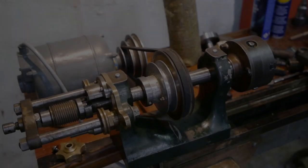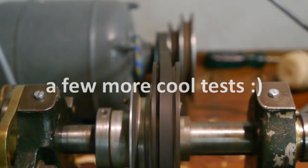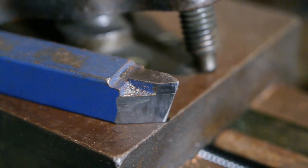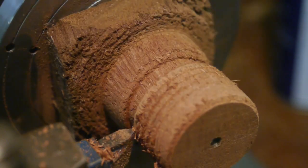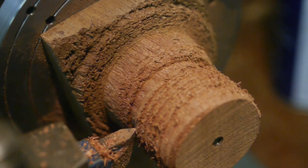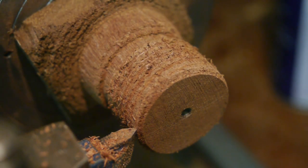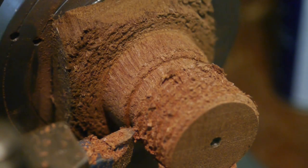The next night I dreamt up a few more cool tests I could try out, so let's do some more wood threading using the old sliding spindle lathe. For this test I will be using a different tool bit - this one has a bit of a positive rake and it is not as sharp. The point has a bigger radius on it. This is a piece of meranti wood, good for making window frames. It doesn't look good - so meranti is no good either.